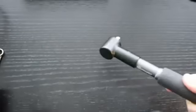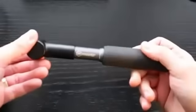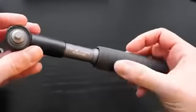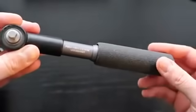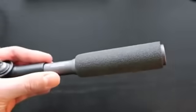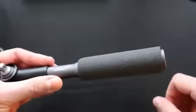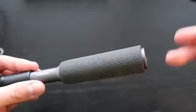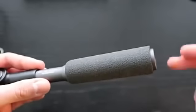Now, let's have a look at the Comeover wrenches. This is an FGC 10 wrench with a torque range from 2 to 10 Nm. As usual, to set this preset tool, we remove the cap, insert the key, clockwise, increase, counterclockwise, decrease.